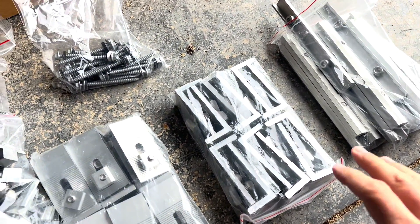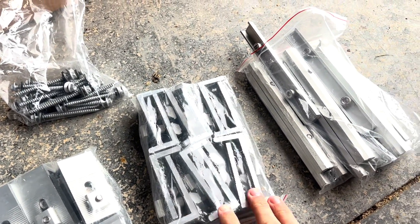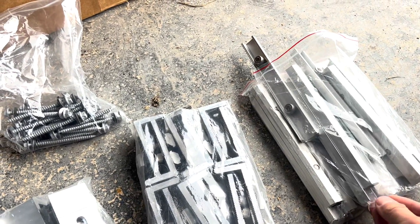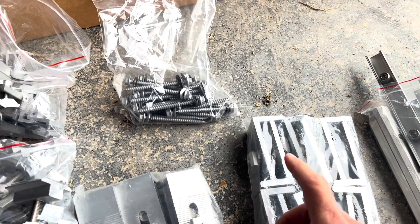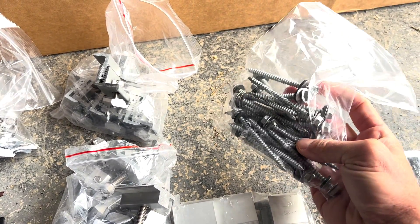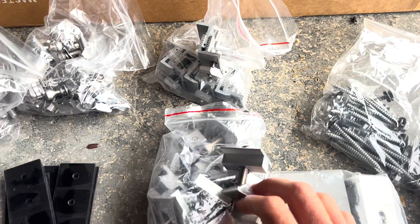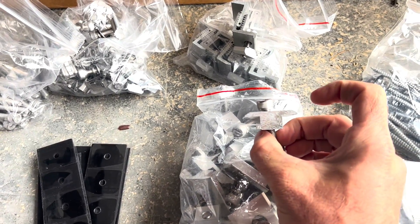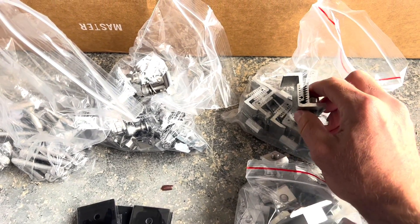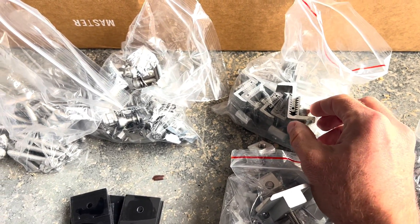With the racking kit comes the feet to mount the racks, the rails to mount to the roof, and braces to put between the rails so you can make them longer and tie them together. It also includes the really long bolts or screws to put the feet down into the roof. The T-shaped brackets go between the panels, and then there are S-shaped looking brackets that go on the end ones.